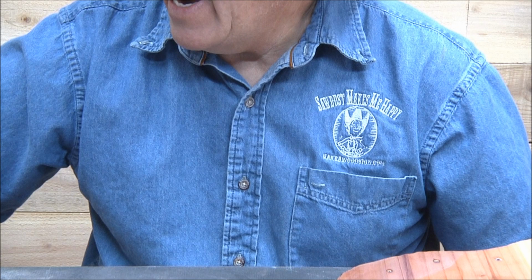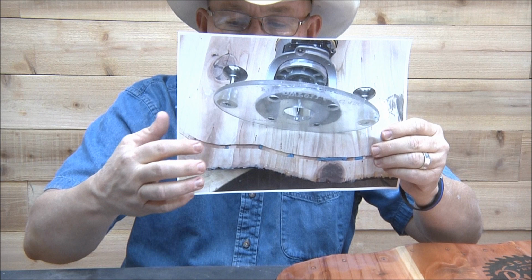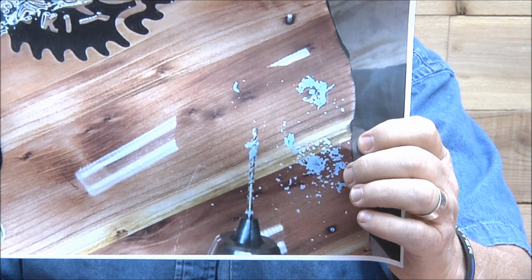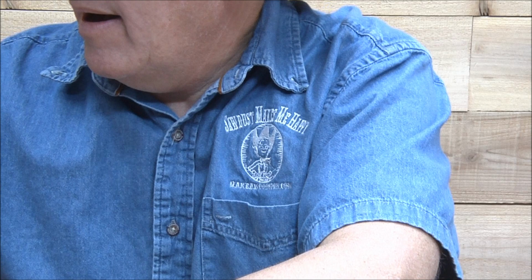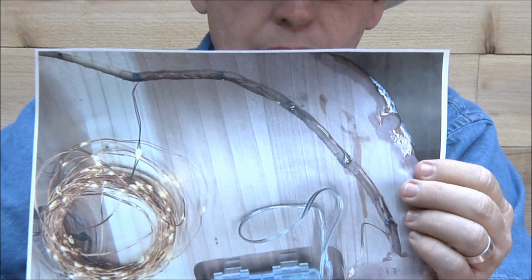And even before then, I had to take the router and actually reroute that line, so then the painter's tape was just in the holes. So I had to reroute that line, clear that line out with a router, and then drill those tapes. And this is what it looks like when I was drilling that tape and resin combination out. Then after I got that done, I had to put those lights in and use hot glue, and I had a buddy of mine help me with it, but we finally got it. But it was several hours of work just setting those lights in there.